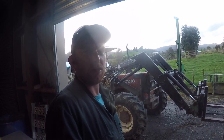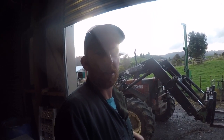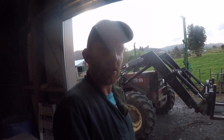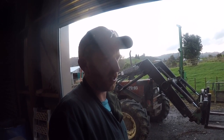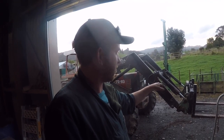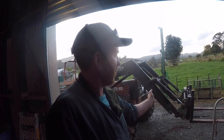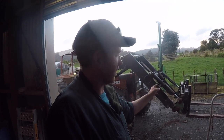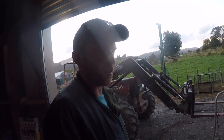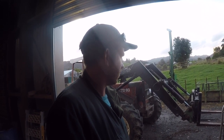I'm so sick of the wind when making videos. I don't have any microphone or little fluffy on a microphone, so if it's windy, the videos are just horrible. And just trying to stand out there explaining that the pins that stop the forks from falling off, the holes are a bit tight, so I might need to file out the holes a little bit just to get them to fit, but there's nothing major.